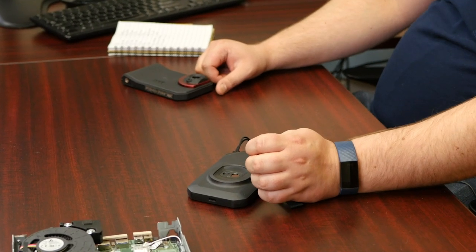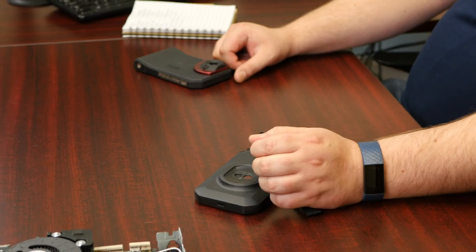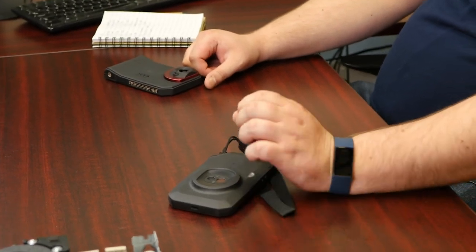Otherwise they're very much similar. They both have a better than 70 millikelvin sensitivity rating, which is the minimum quantized amount that the detector can discern between pixels. That equates to 0.07 degrees Celsius, but that's really more about contrast than actual accuracy. They're both going to be about plus or minus two degrees Celsius for most applications.